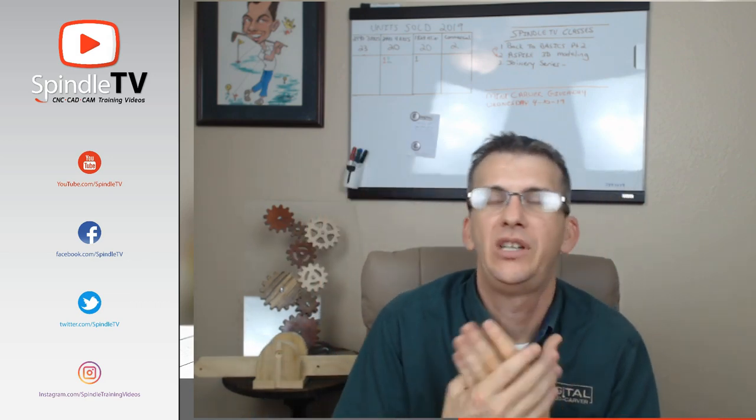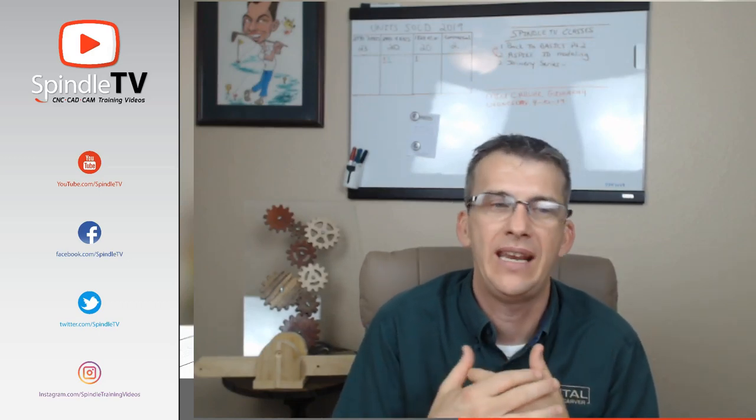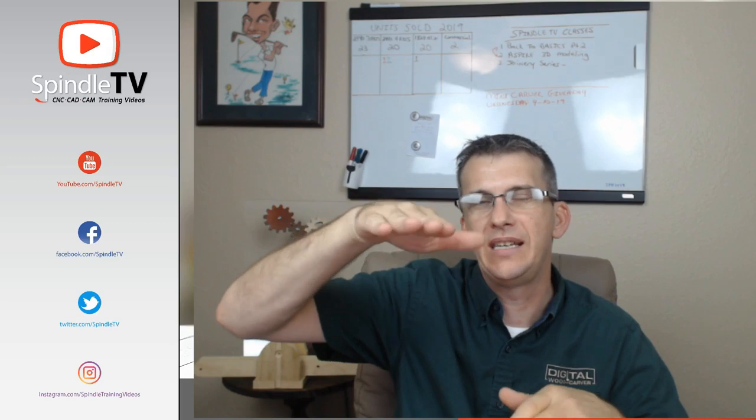But Jeff says, Lainey, do you recommend surfacing in one direction even for large beds? I have the 48 by 96. That would double the surface time, wouldn't it? Jeff, I don't care what size your machine is. I would highly recommend surfacing in one direction to prevent tear out. And we're always conventional cutting with a surfacing cut. With conventional and climb, there's a potential of me getting little ridges and things like that in the machine. I always recommend cutting in one direction.